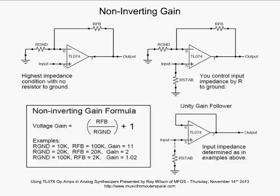Now let's move over to the right, and we see we've put a stabilizing resistor from the non-inverting input to ground, and that resistor is typically going to be a higher value, 100K or 1 meg. And now the reason that's there, let's say that you have a capacitor that's taking an AC signal and connecting it over here to this input without the stabilizing resistor. Well, we all know op amps are not perfect circuit elements. The inputs have what is called offset current. You're going to get the slightest tiny little current that's flowing either into or out of these inputs. It's in the picoamp range.